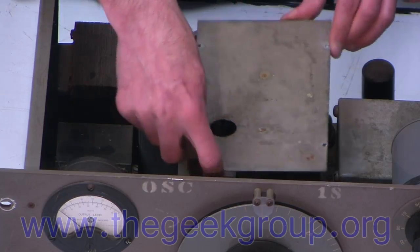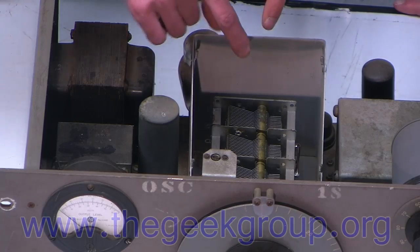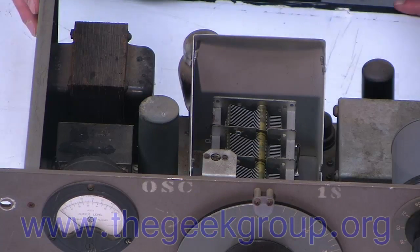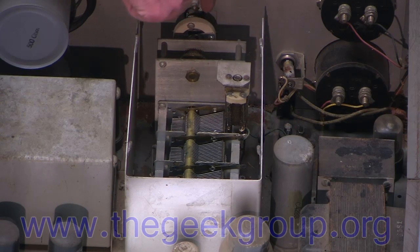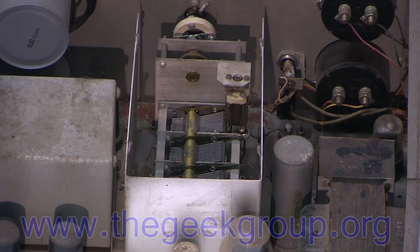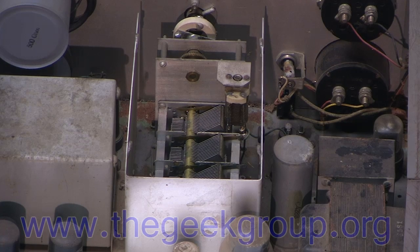So let's look in here. We've got a cover, and I've done some pre-disassembly — I took some bolts out to make this go a little easier. And this is just a shield. But the cool thing is this: this is the main frequency knob up front, and it comes through. There's the linkage that comes in from the front, and this is a stop that keeps you from turning it too far. And then there's this, which is an alignment fixer, basically — it allows these two different shafts to be a little bit out of alignment and everything still work.